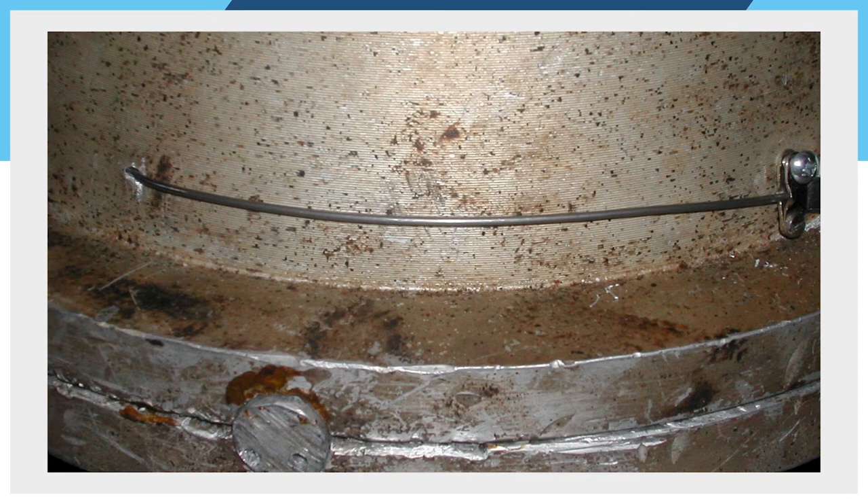Maybe the parting line has already been damaged and is leaking powder. Plastic gets in between the flanges and melts as before. So you can see lots of reasons, and nearly all the time your current stick-up problem is the result of something that's been done wrong or neglected during the previous cycle.